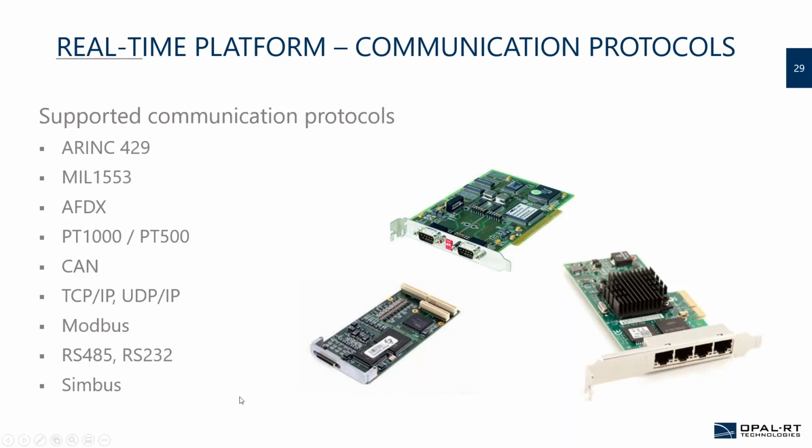It's always important as well. From my previous experience, we had a customer, not related to the ECU, who wanted the bench to talk to a mainframe, a main controller in the lab. Especially in Nuremberg, I had a really neat customer who built an architecture with a central controller PC and defined a bus where they can control all benches. All suppliers of benches are required to talk to this communication port. It was actually TCP/IP with a predefined packaging. From there, the main controller can start the benches, change parameters, and control the benches remotely, which is really needed during test sequences.